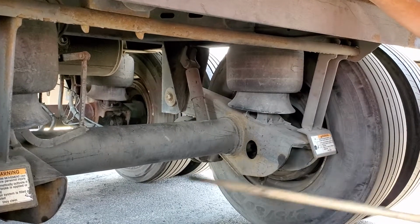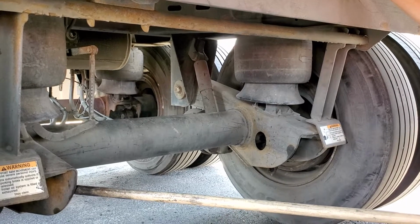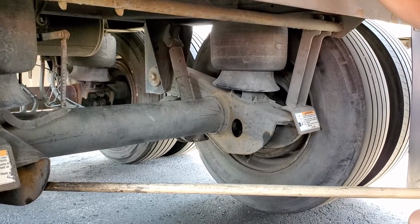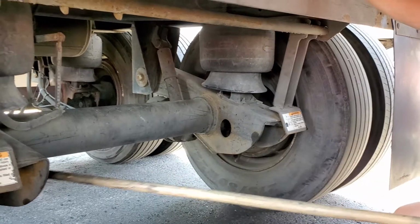So check for these. As you see, it's not very thick. I cracked this long on the end here. By the time you get to California, it's up to here now, because you got 45,000 pounds of this bucket right here. So check for leaks, check for cracks. So now again, not bent, broke, or cracked, and not shifted.